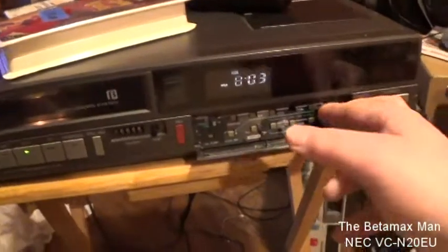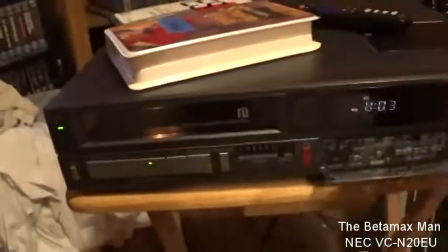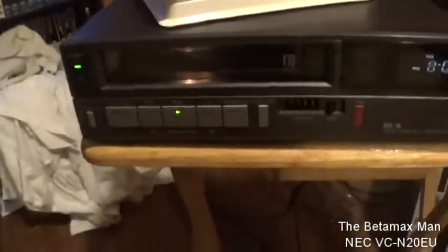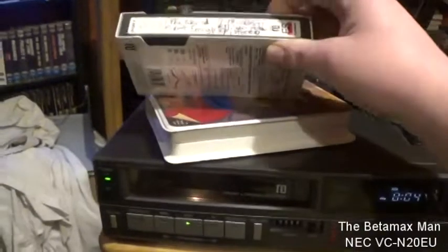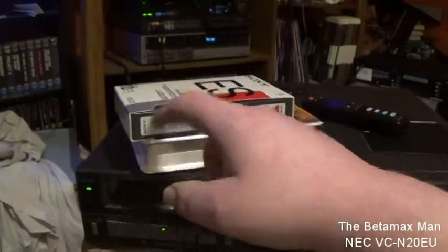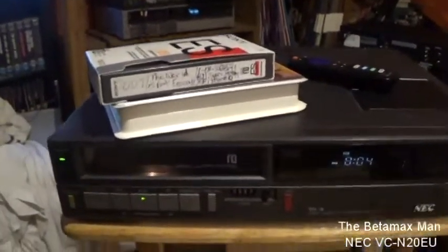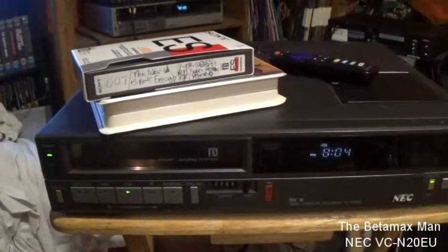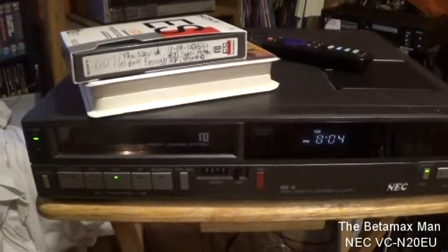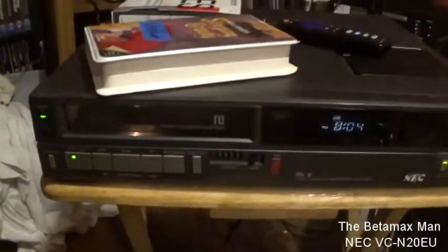If we put it back in the center you can see the tracking is just a hair off, but this has been adjusted. The tracking is perfect on this thing — I used one of my tapes recorded off the SLH-1000, a 007 tape I recorded a few days ago, as my reference tape and done the alignment with that. The tape guides were also loose — somebody had been monkeying with the entrance guide.